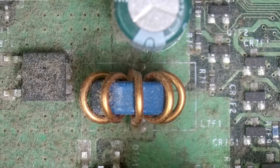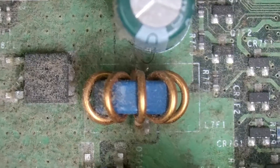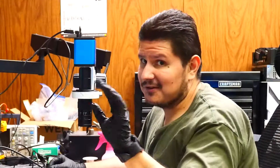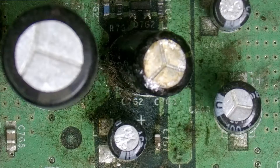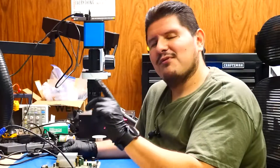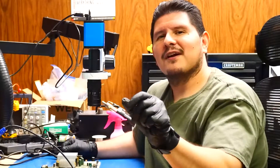I don't know if that's the tail end of some kind of a bug hanging out there underneath that cap. No dead spider in this one though, so no funerals and no donations required. And there of course is our clock capacitor leaking all over the place, just continuously ruining this board — and probably ruining your Xbox at home right now.